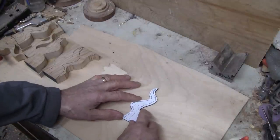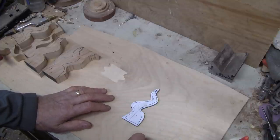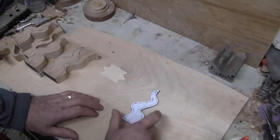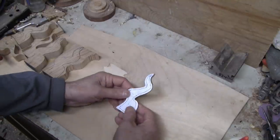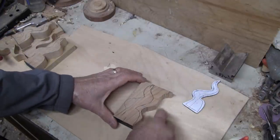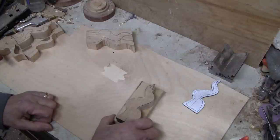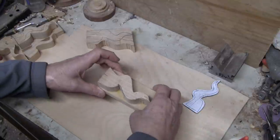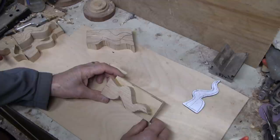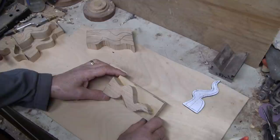What I have here is a template — it's the profile of the segments I plan on making and gluing together. It doesn't look like a typical segment but it's actually going to be one. I'll take this template, which I've drawn on the computer, trace it onto this block, bandsaw that shape out, and glue it onto another block so I can fasten it in the milling machine and cut it. Let's get this over to the mill.